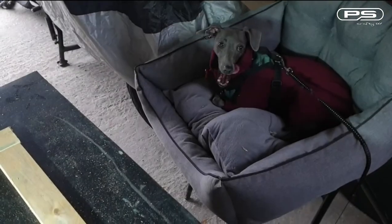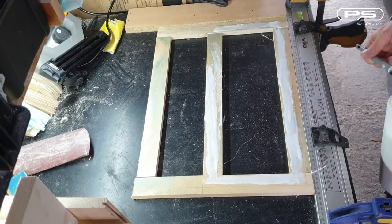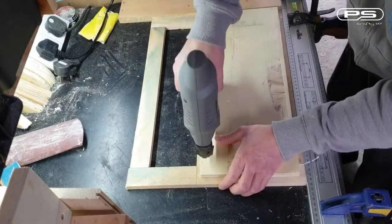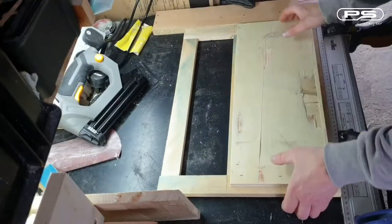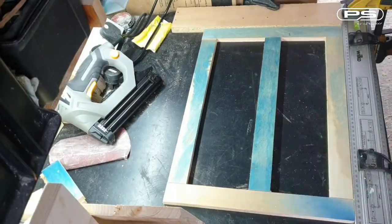And it's all being strictly supervised of course. Now I can join the pieces together using the good old Gorilla Glue for the structure and PVA for the panel insert. Align the insert with the mating lines and drive in a few staples to keep it in place. The link at the top takes you to a full review of my Titan nail gun. The top piece will be attached at a later stage as now I need to make another panel for the opposite side using the same methods as making the first one.